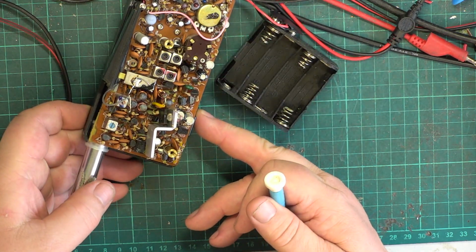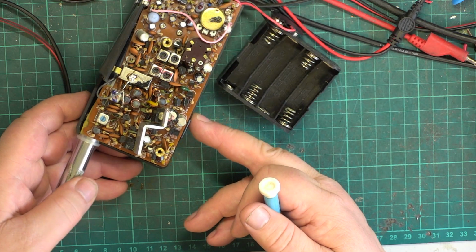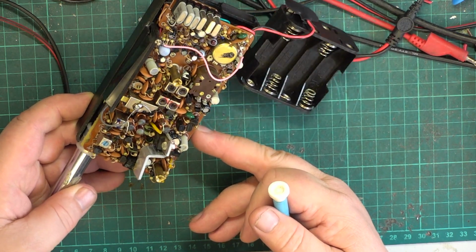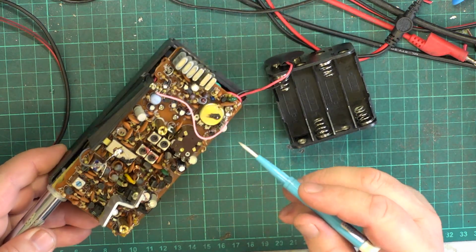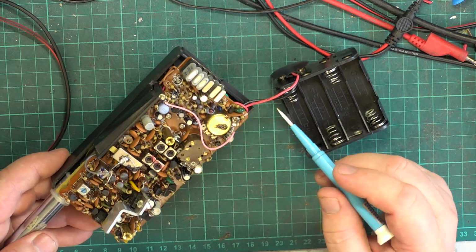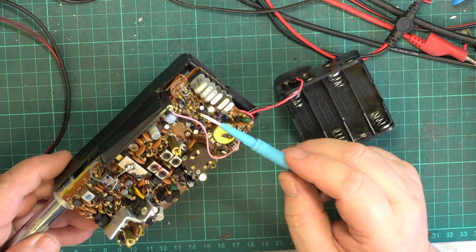Looking at 2 filters, 455S and then 455HT. Again, being a cheap product, it doesn't have trimmers for the individual crystals, so what frequencies it may have, it may have an overall adjustment, or it may not.